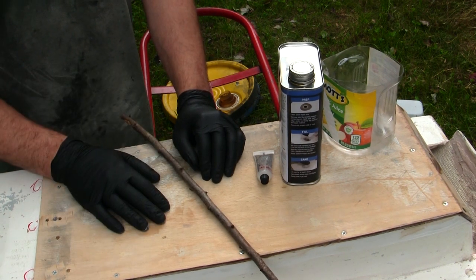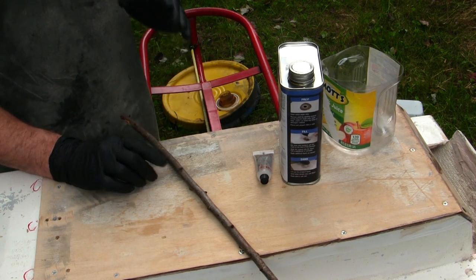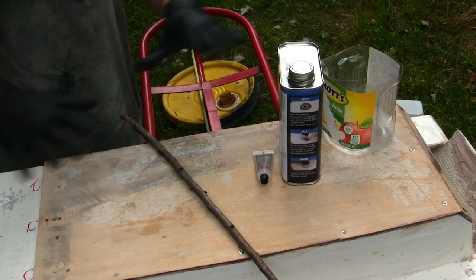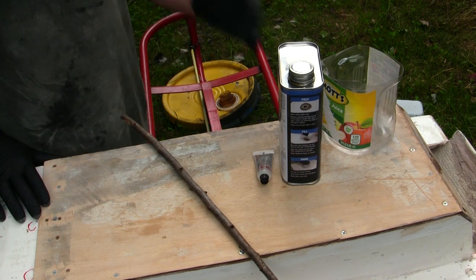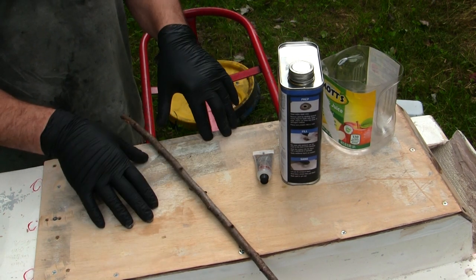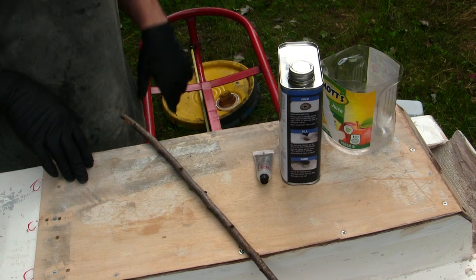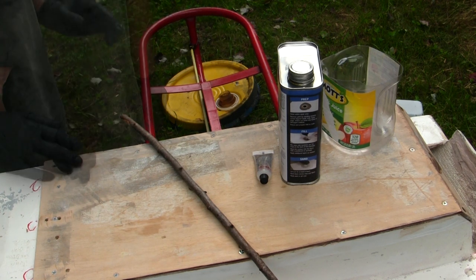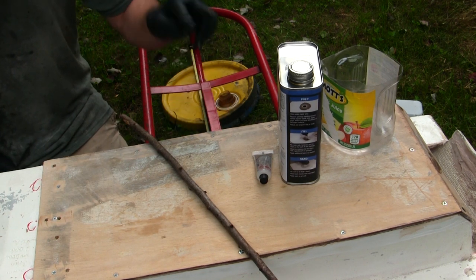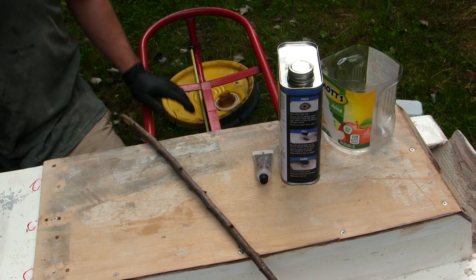So, one thing about fiberglass resin is that you are on the clock. Fiberglass resin is a very, very fast-setting mix. And it's one of those things where once it's mixed and it's active, it's go time. So you want to have all your ducks in a row, and you want to have everything laid out and planned out before you do the application. The other thing about fiberglass resin, you'll notice I am wearing gloves. Of course, I'm wearing more than one pair. I'm actually wearing three pairs because this stuff is very, very abrasive, and it will just eat through latex gloves like a hot knife through butter, specifically once it starts setting. Two other important things you need for fiberglass resin are environmental. You need heat, and you need sunshine. Being in the mid to late August period when I'm filming this, luckily I have an access of both.